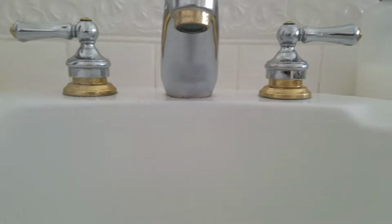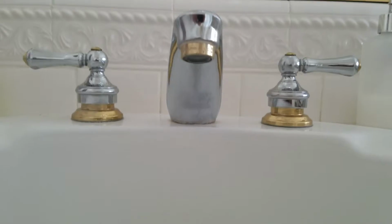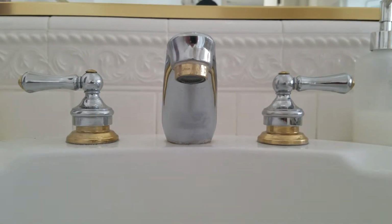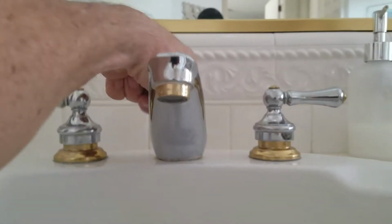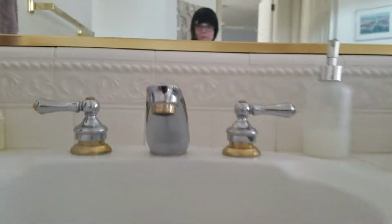One note, we did notice that you can see the corrosion around the bottom here. Also underneath the sink, there's some water getting by somehow. Can't tell you how. All I know is it's corroding up in there. I'm not going to take a picture of it, but the mounting nut and then the bracket that operates this lift lever down there, it's scaled up. No active leaking, but there was something going on there. That's not part of the scope of work.